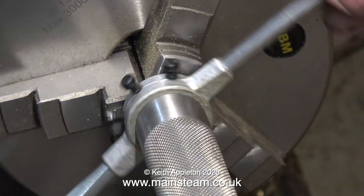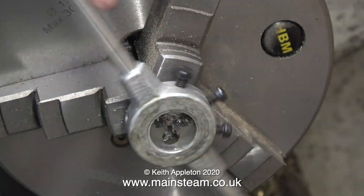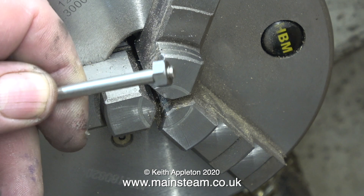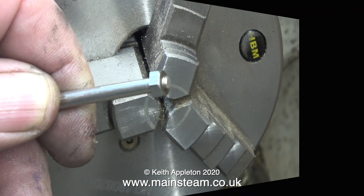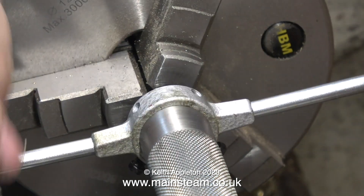I need to thread this for a distance of a quarter of an inch. For this job the lathe is not running under power — I'm rotating the die stock manually and frequently backing it off, and by doing it that way I get a very good thread. To test how good the thread was, I used the 2BA nut as a reference. Then I removed the nut and fitted the piston rod back into the chuck the other way around.